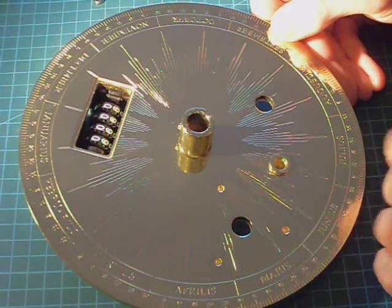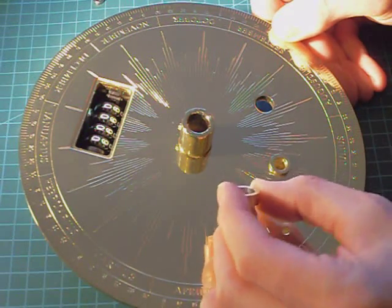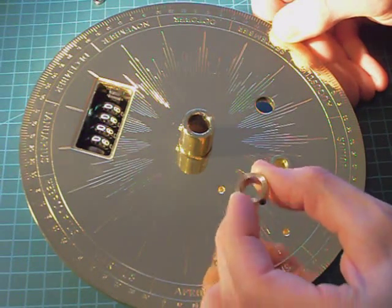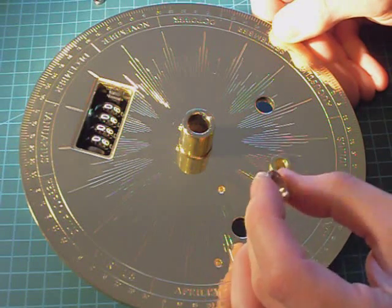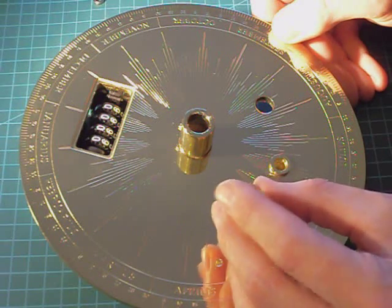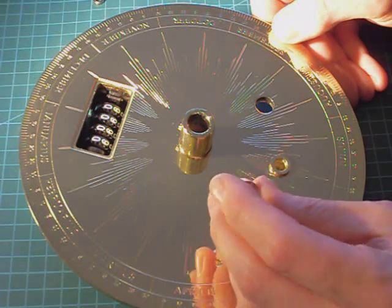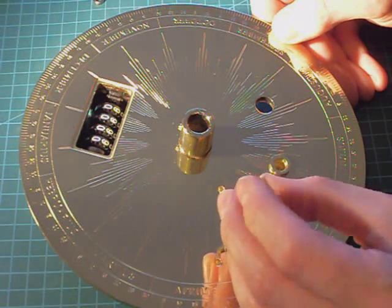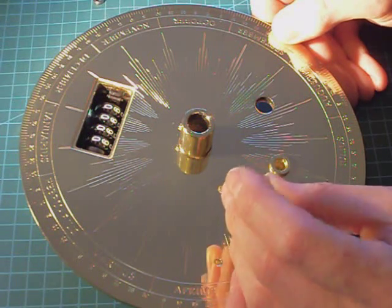The solution is to lock the bushes in place with a small brass collar fitted with a grub screw — an M3x3 grub screw. The collars have been drilled slightly oversize because there is variation in the taper and thickness of the various bushes, but in this case a small amount of shim was placed inside the collar just to take up any slack.